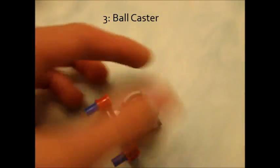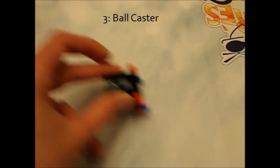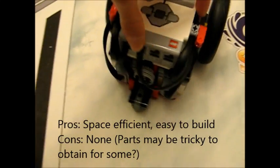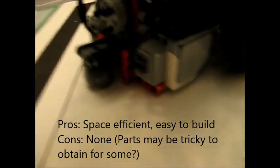So now that brings me to the next design: the ball caster. This is now my new favorite design. It basically consists of a small metal ball that you pop inside of a socket, and that's it. The ball lets you rotate in any direction you want because it's just a ball — it rolls around. And the socket is very space efficient because you don't have any parts that swing around like in the traditional caster wheel design.